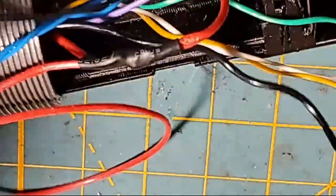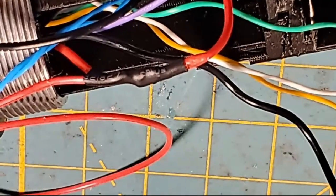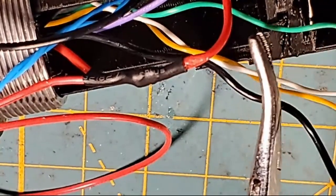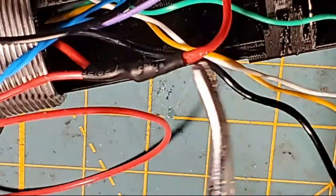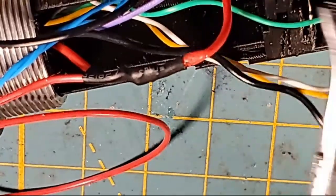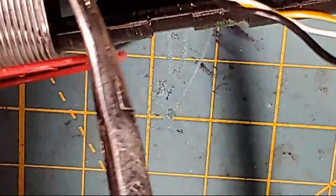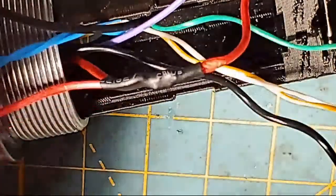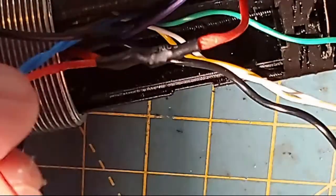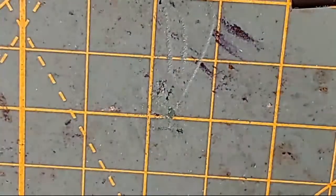So anyway, just really quick to let y'all know what's going on before we cut out from here, because I'm not going to get to install this tonight, obviously, because we're definitely running out of time. This is our positive from our battery positive terminal that we just soldered on here. The thicker positive is coming from our NeoPixel adapter. They're merged here onto a 26 gauge wire. And this 26 gauge wire, which is way too long, is going to feed our Proffie. We really only needed a piece a couple inches long, so I don't know why I did that.